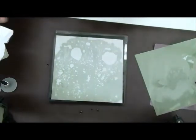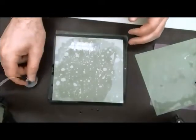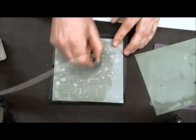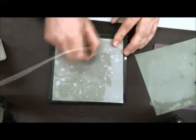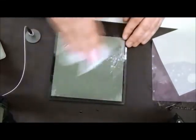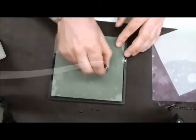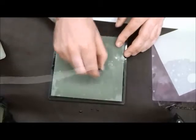Placing the white polishing film on top of the rubber mat, using alcohol and the proper cleaning cloth to clean off your white polishing film. Then place the polishing puck on top of the white polishing film and perform 15 to 18 1 to 2 inch figure 8s moving across the polishing film. Placing the green polishing film on top of the rubber mat, clean off the green polishing film with alcohol and the proper cleaning cloth. Then place the polishing puck on top of the green polishing film and perform 20 to 25 1 to 2 inch figure 8s.